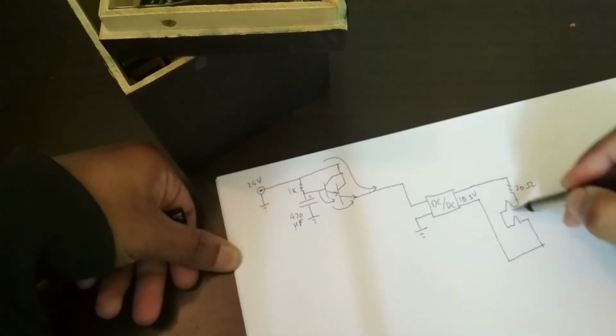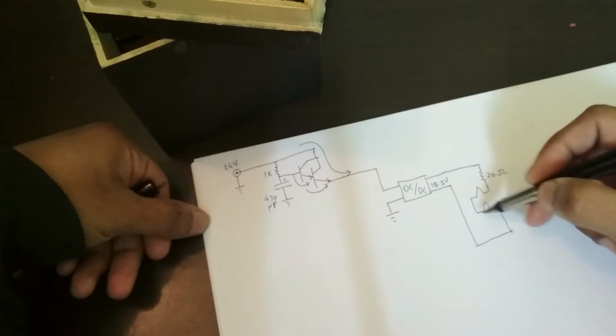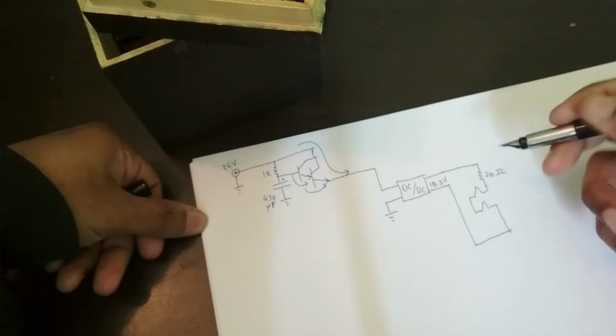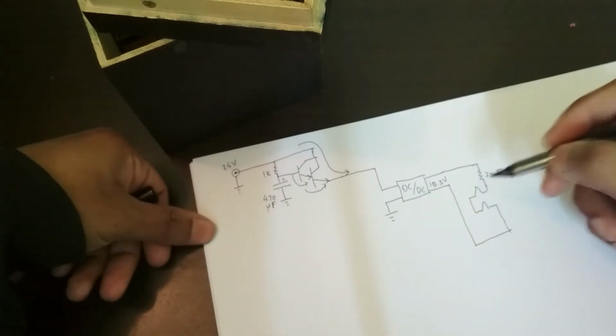The thing with metals is that the resistance goes up with temperature, and so in light bulbs and in vacuum tube filaments, which are really very similar, the initial resistance is low because they're cold, but when they heat up, the resistance gets higher, and so the current goes down.